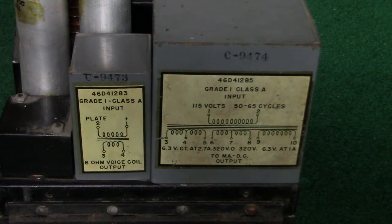This thing, and equipment like it, when it's turned on, do not touch the wiring inside. If it's been turned off, recently at least, do not touch the wiring inside, because you're going to get voltages of 300 volts DC, and it is not safe, and it is very dangerous and potentially lethal to you if you get shocked by the high voltage.